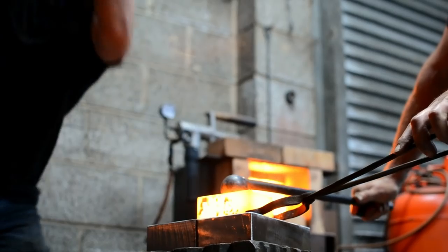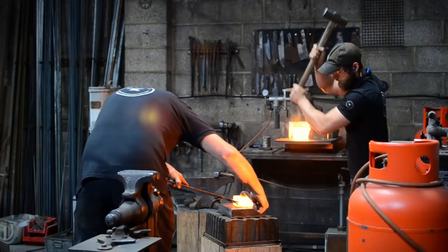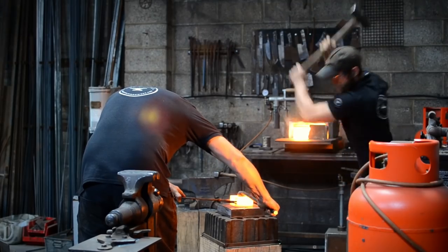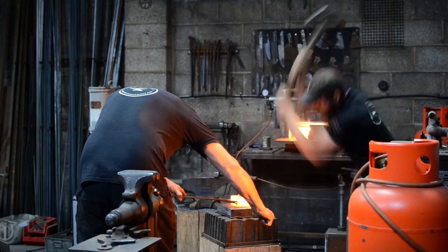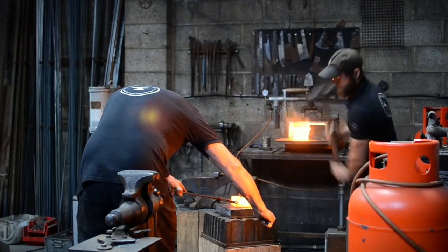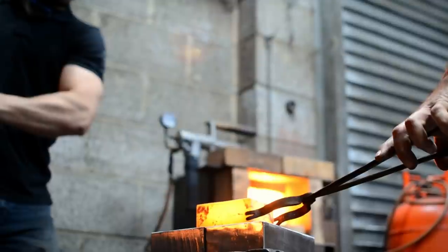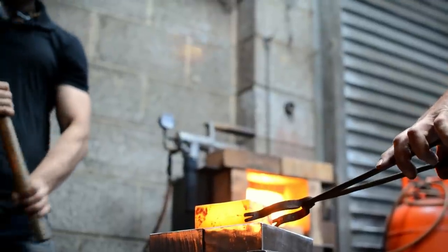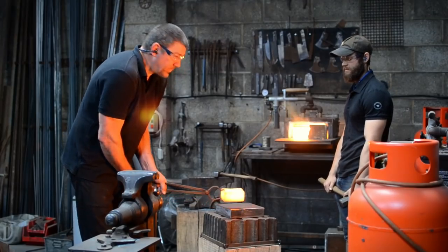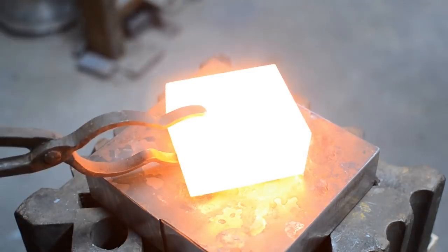You couldn't hold the block, hold the tooling, and strike with a sledgehammer. You could find a way but it would take a hell of a long time. With two people, you've got one person ready to strike, one person ready to lead, and you rotate — that makes it much more efficient and you get a much better end result. That's the traditional way of making swages. Mostly they're cast — the big swage blocks are cast steel or cast iron — but these we made specifically for this particular item.